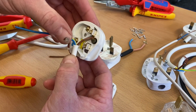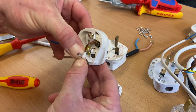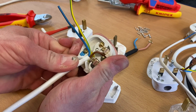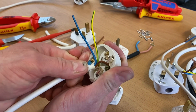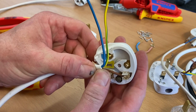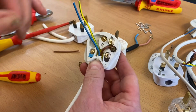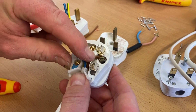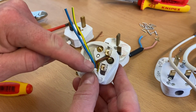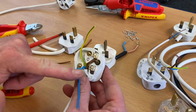Now I place it into the cord grip. I lay it into position so the white outer PVC is beyond the cord grip and push it down into place. It bulges up slightly so I pull it back a little, adjusting so the conductor sits just a bit closer to the bottom, then push it all the way in. With a little press, the line conductor sits nicely into the valley of the cord grip. Line connection is complete.